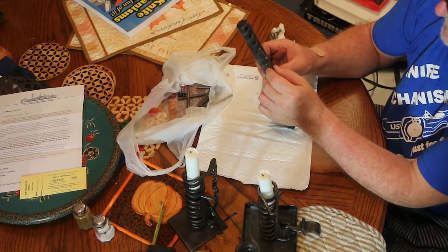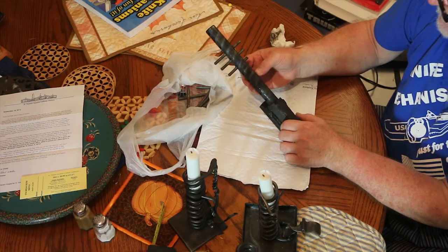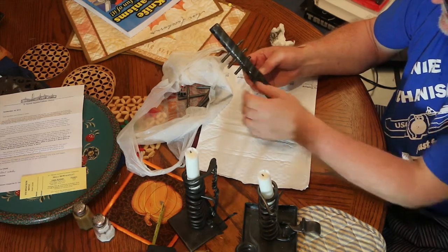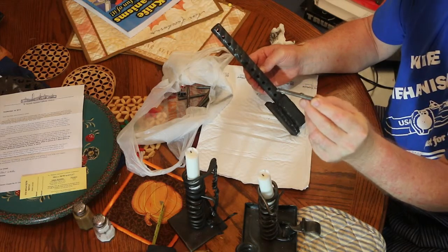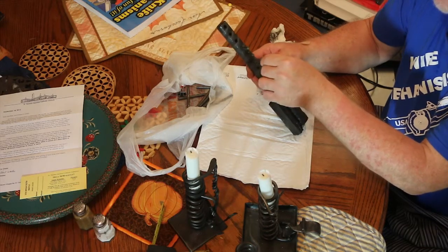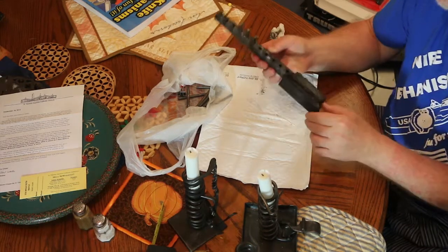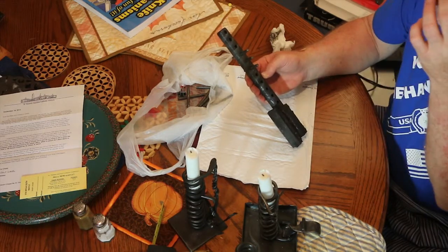I put these quarter-inch rods in there and I sort of positioned it flat. But what happened was that these rods were just falling out, so I took a little bead of weld on there, and then put this in the vise where gravity was pushing down on there, and that seemed to work out pretty well.